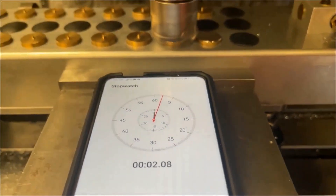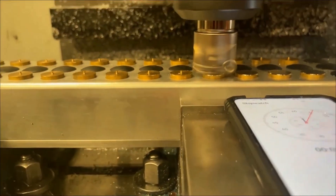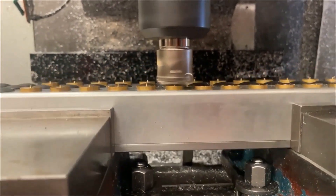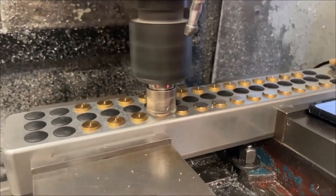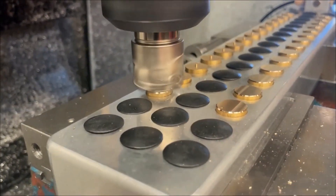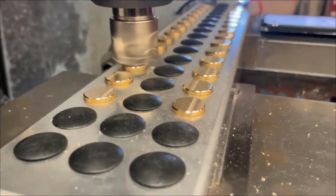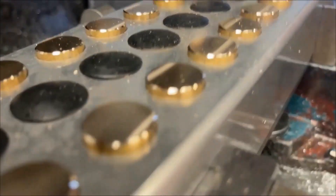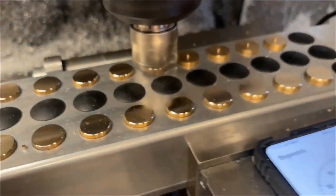This clip shows a standard button cutter machining extra features. It faces off two parts at once — just one pass, no back cutting — and the finish comes out at the submicron level. Then it feeds down to put a chamfer on top. There's a tiny dip, maybe two tenths, right in the middle, but both corners are exactly where they should be. I'll take that any day.